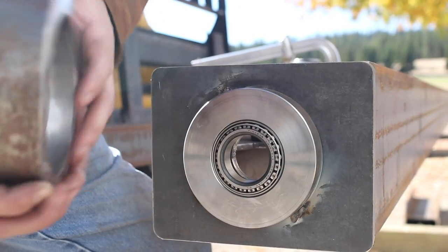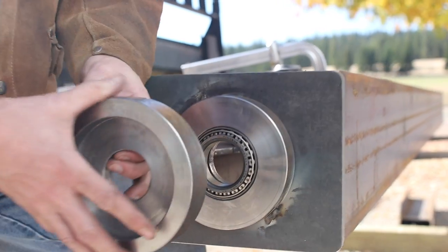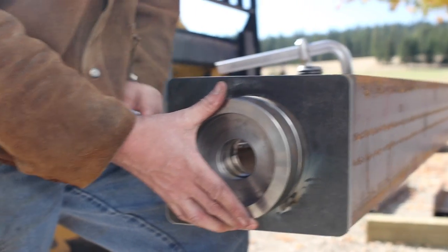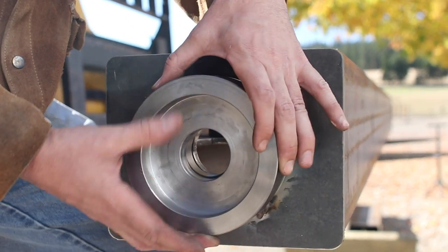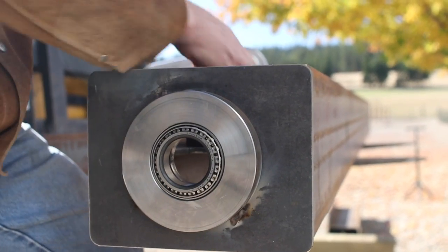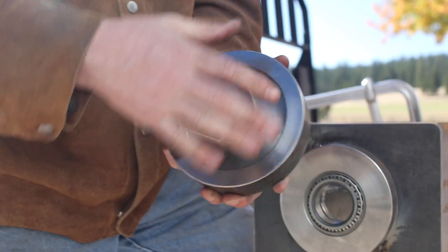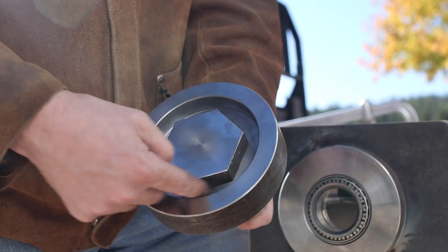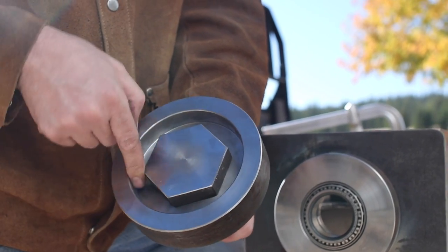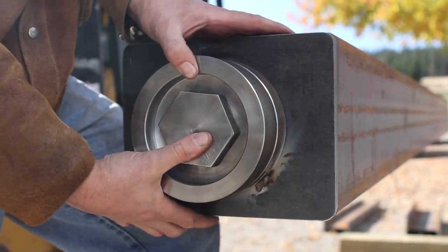The next thing that goes in is this plate right here, the side of the bearing, and this surface seats there just like that. This gets welded to the base plate on the floor, okay? And what holds this all together is just this pin. This big pin goes in here just like that. Reid's machined this for me, and I'm gonna end up tack welding this into place, and this pin's gonna hold all this assembly together.